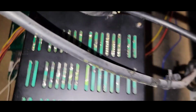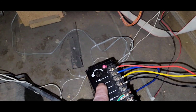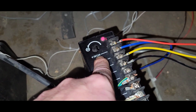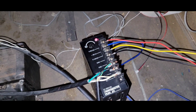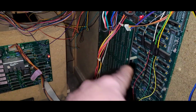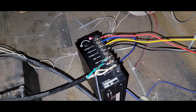Yeah, I got a feeling that is what the issue is. But no wonder that resistor was burnt, because it's cranked. And that's what's causing the issue. Now, when I first installed this board, this was an empty cab. When I first installed this, I was getting a good 5 volts, and I wasn't having an issue. It just got worse and worse over time. I got a feeling that it's this. This setup is asking for too much, and this is getting its ass kicked.